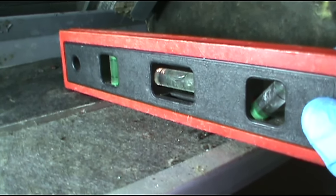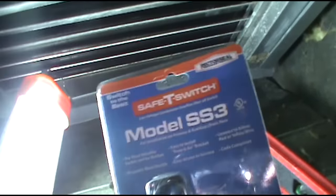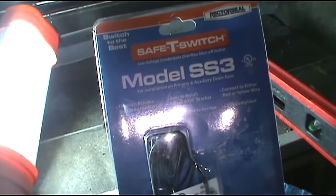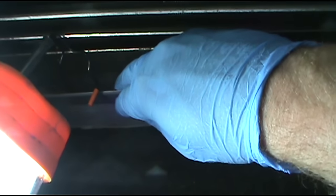Look how far off that is - that's balanced, and that's where I'm sitting. What I'm doing to combat the problem - my idea is to put in these clip-on float switches. They just clip right here on the side of the pan. So I'm just going to put in a clip-on and do away with that, because it's still going to overflow. We have safety - usually they go into these secondary pans here for leaky water heaters, and it drains out into the breezeway downstairs. But I don't want that to happen, so I'm going to put in a clip-on and that should do it.